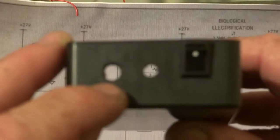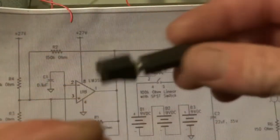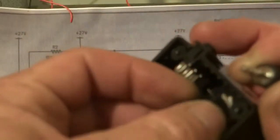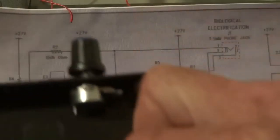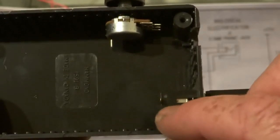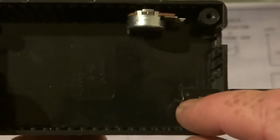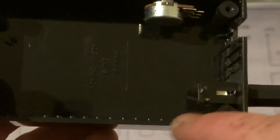This other hole here is a 6mm hole — that's for the 3.5mm plug socket, which basically goes in the hole and plugs into the device. The difference with the mono plug is when you plug that in, this pin and this pin disconnect from each other. This pin here is one for the electrodes, and the main pin there is the one for the electrodes that will come out. This one here will disconnect from the capacitor, and therefore it will disengage the flashing.